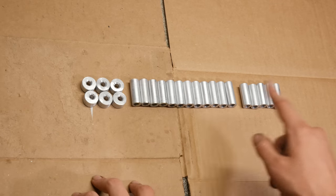The next thing we're going to make are the hold-down straps for some of our components. To hold the HDMI switch in our 4-receiver unit, we'll use this 1-inch wide strap bent around the top of it and used to hold it down to our housing plate. We'll also be doing the same thing to hold down our batteries. Between the two units we'll have three of these batteries, so we'll need three identical strap hold-downs using this three-quarter-inch wide strap. The strap will go across the top, bent down and bolted to the housing plate. One strap per battery should be fine — we can always add a piece of rubber or gasket material to help it grip the battery later on.